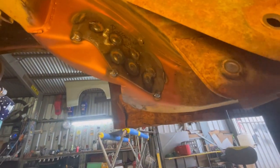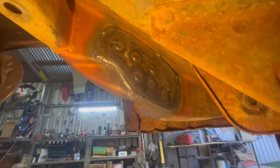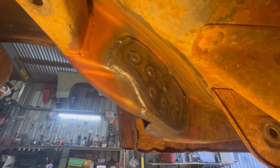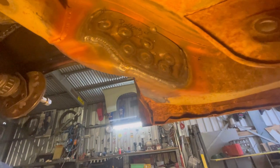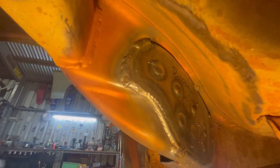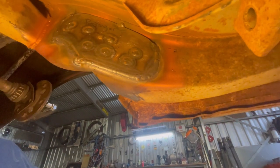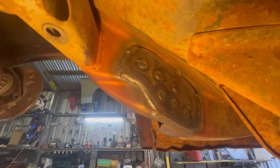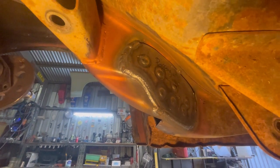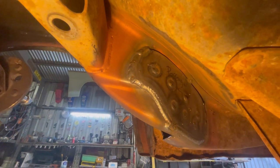Majority of that's all welded in. Apart from that little top part, I'm going to weld that once the car is on the rotisserie. Not the prettiest of welds - I won't claim to be the greatest welder in the world - but it's not going to fall off in a hurry. There's plenty of burn-through on the other side so I'll chalk that up as a win. That'll get a little knockback with the grinder, and if there's anything suspect I'll just re-weld it.